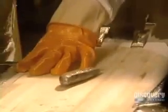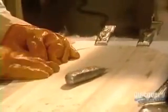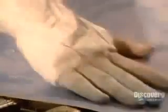To make working on it easier, the board is securely held in place by clamps. Epoxy, an extremely strong adhesive, often used with composite materials, is applied to the fiberglass at room temperature. It is essential to remove any excess epoxy, as well as eliminate all air bubbles so there will be a good adherence.